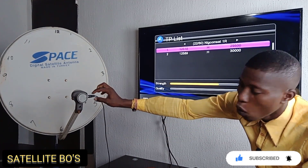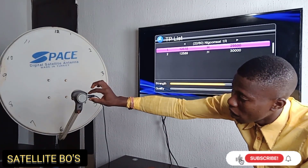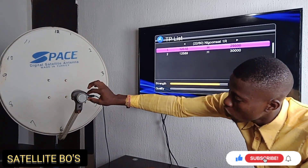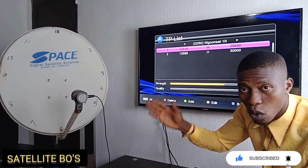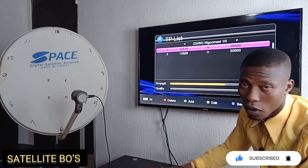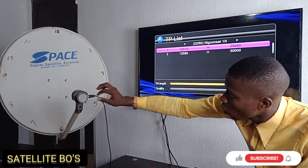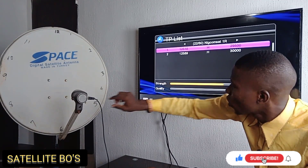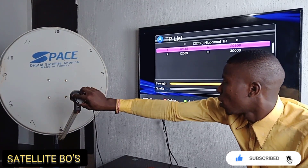Now, how do you know the time that your LNB is telling? This spot — where the signal wire enters your LNB — that is what tells the time. A lot of people get confused by this. The LNB input point is what you use to read the clock position. Right now it's at about three o'clock; come down a little and it's four, then five o'clock.